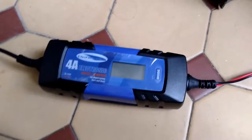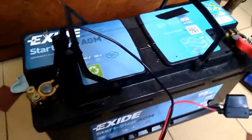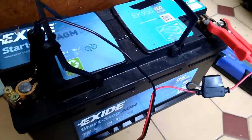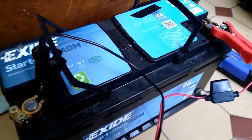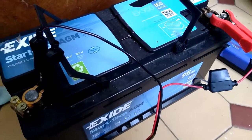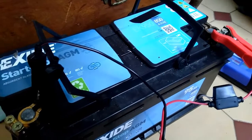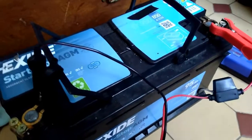And what I had to do was to watch the voltage, because the voltage drops off suddenly with the charger as it sees that what it thinks is a 6 volt cell is overcharged, or charged adequately at least. It drops its own output voltage. So what I was doing was watching it and getting an idea of the pattern that it used to provide, say for example 7.2 volts. I'd watch it for about 4 seconds, and then just before it dropped its voltage I'd disconnect the crocodile clips, and then what you have is like a reserve voltage on the battery, and you're able to climb from there. So you're not always going 2 steps forward, 1 step back. You're always trying to do 1 step forward, 1 step forward, 1 step forward.